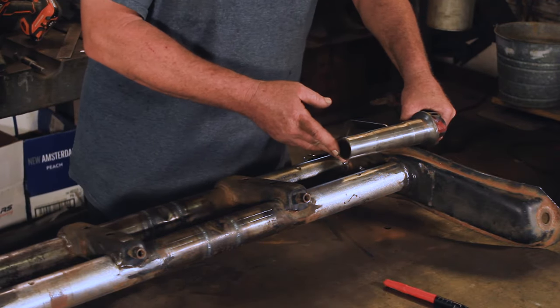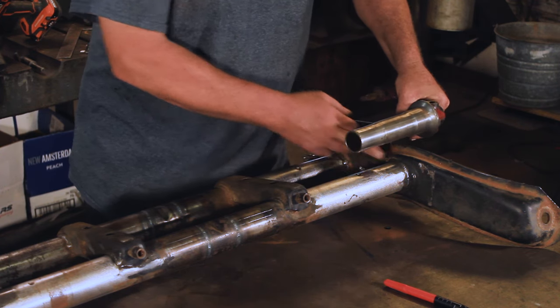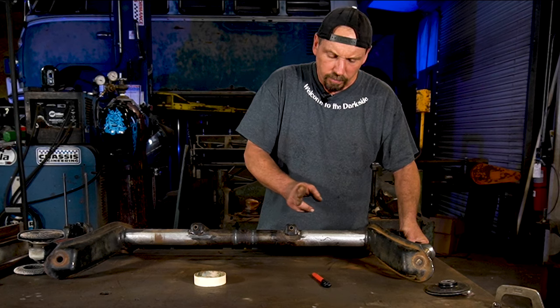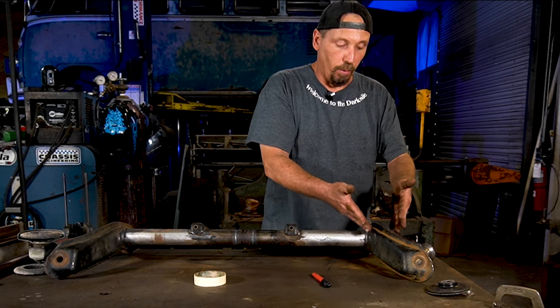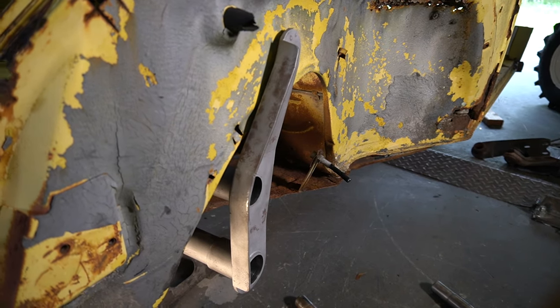Well, you wanna make sure your trailing arm, that's where your bearing is, so you want to make sure you're inside of that. You don't want to cut it out anywhere where the bearing was. So we're going to cut an inch out of both sides, and that's just because the shock tower will still fit. There's some notching and stuff like that you could do if you need to get more or change the shock tower altogether. That's how we do our narrow beams with the hydraulics.